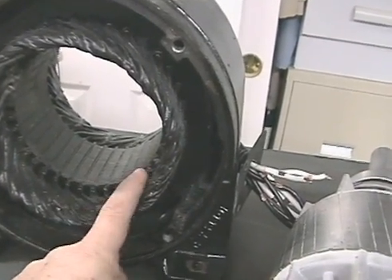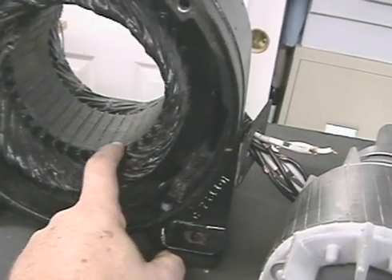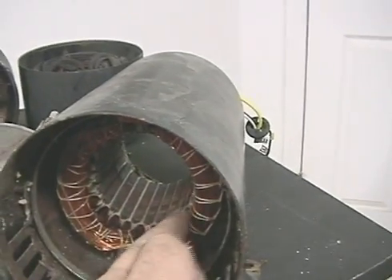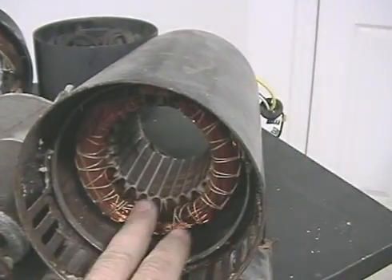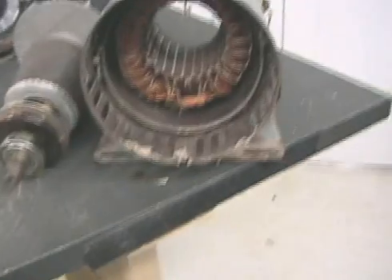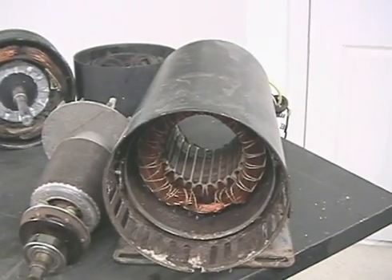The windings wrap around and tie together, happening through the whole motor in sequence, then broken into three subsets of coil windings to give you three phases. The coils only span about four slots. In the better motor, this is a field, this is a field, and there are fields here and down here too. The motor itself just seems to be wired wrong for proper induction when used as a generator.